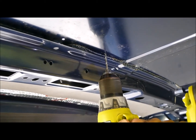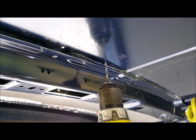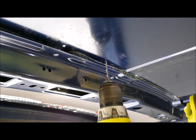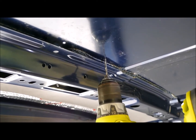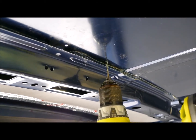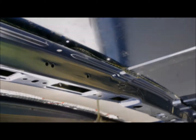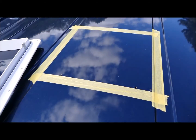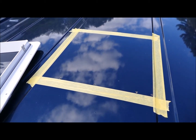The fan requires a 14 inch by 14 inch cutout in the roof. That size opening just fits between the aft-most roof bows of a Ford Transit, about 20 inches or so in from the rear of the van. The first step was to drill pilot holes from underneath to mark the corners of the cutout. Then I marked the outline on the top and masked around it to protect the paint along the outside of the cut as the jigsaw cuts the hole.